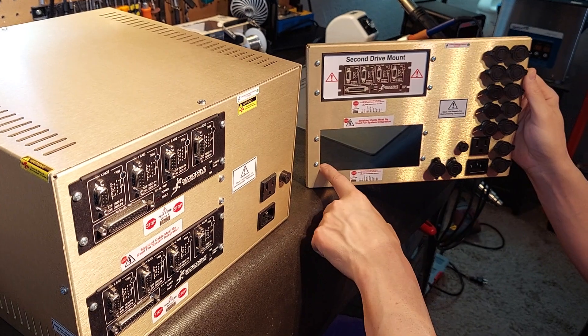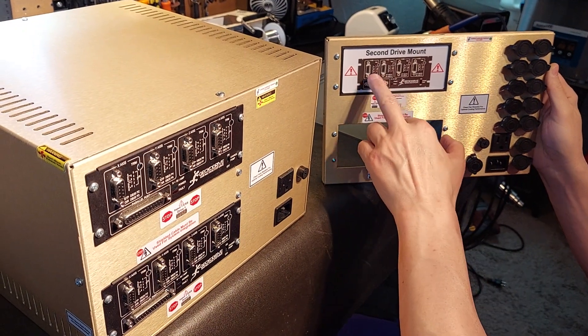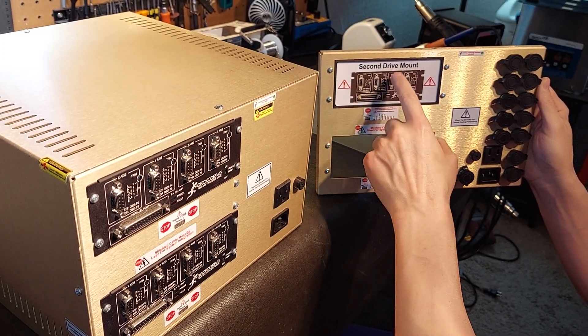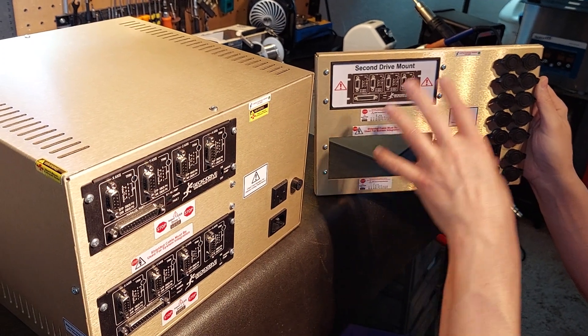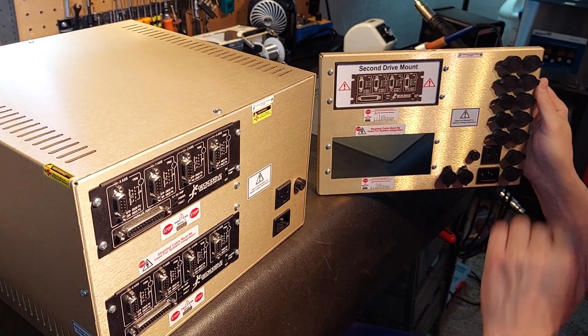Why is it the easiest? You've already got a four-axis drive installed here, and on this top port we would install another G540 with only one drive installed in its black case. You'd only have one port being powered — on your X, Y, Z, or A axis — and either way you could expand at will to give you as many axes as required for your system, growing it when you need it.